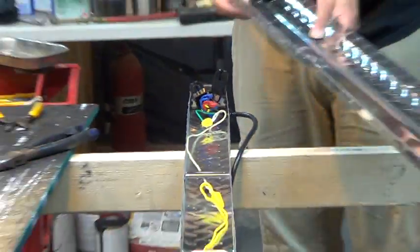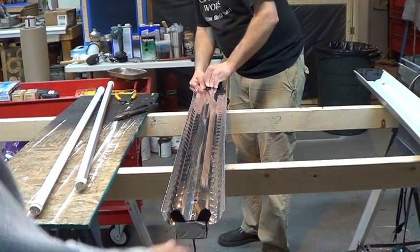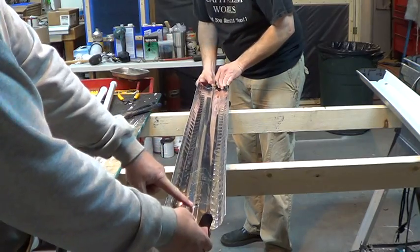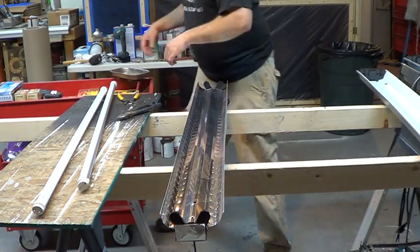We're done — really, that's what it looks like. All right, let's see if this was an easy one. So there were two screws on that that we just put back. This is where the switch was — that's gone, that's one less thing to go wrong. The ballast is removed. It's wired straight.